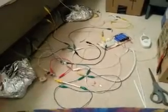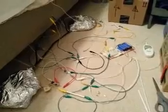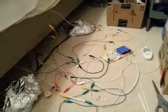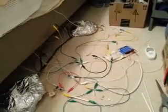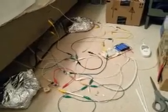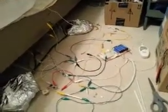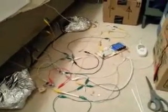You have to make sure that all your components are insulated from the air, because you don't want anything shorting out, going through the air. Even a mild short you can't see. Short of arcing, just tunneling, ionic tunneling, we don't want that either. So I'm trying to move in that direction to make it look like it would be more or less a permanent circuit, even though I still want to leave myself open for changes, so I'm not making anything permanent at the moment. But I want to make it look that way.